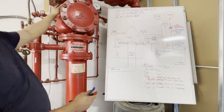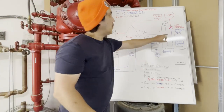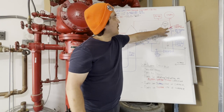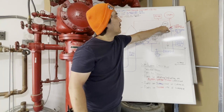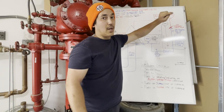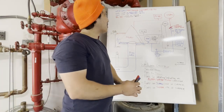That system port is right up here in the video. I like to actually switch this arrangement around — I like to have the excess pressure pump discharge shutoff valve downstream of the check valve. I will explain why later, but for now let's just go through this.